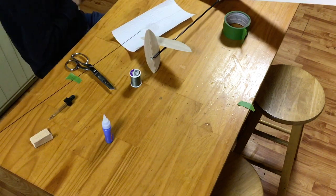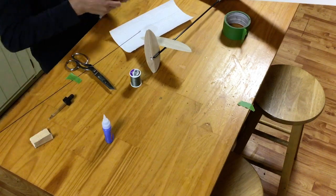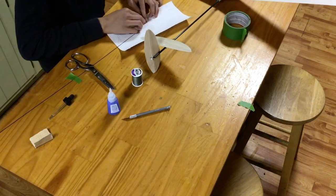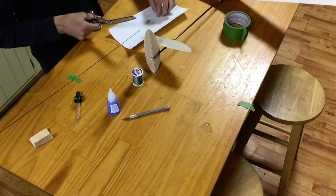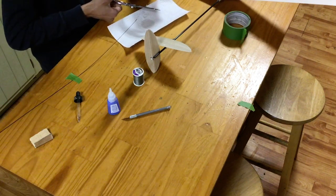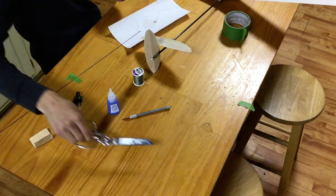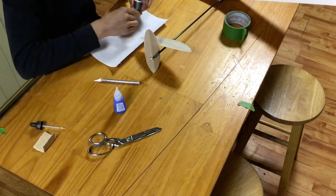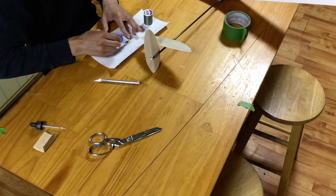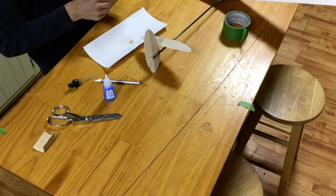I'll then put a paper towel down underneath where the carbon fiber rod and the thread meet in preparation for some gluing. I'll then take my scrap balsa and, cutting off a small section, I'll glue it to the thread such that it acts as a limiter and disables the thread from slipping back through the tail boom. I'll then cut away the carbon fiber rod as it's no longer needed for this step. I'll then attach a similar limiter to the other end of the thread to make sure it can't slip back through the tail boom either. I'll then cut away the spool of thread, which will then also no longer be necessary.